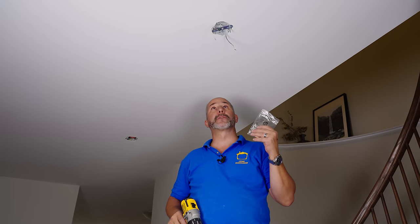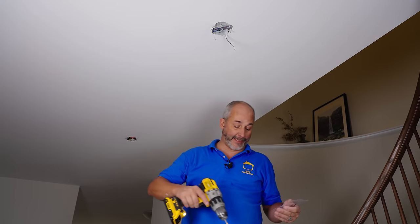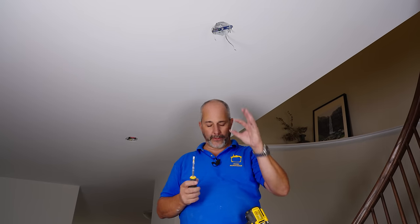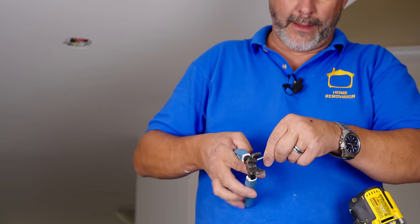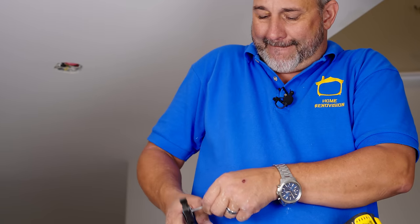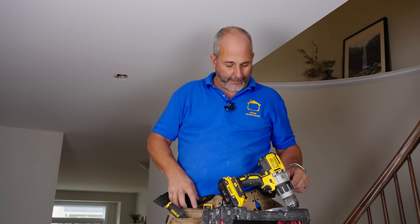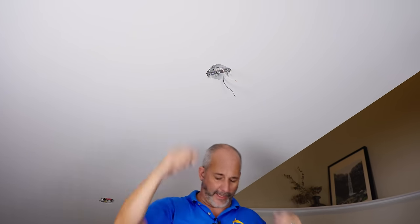Almost all of these screws are 8-32s. If you're an apprentice electrician trying to mount fixtures with a two-inch screw, do yourself a favor: grab your cutters, put the screw in, screw it in there, then cut the screw down to the right length. Don't put them in long. The octagon boxes come with their own short screws — use those because they're the right length. If you're an electrician with an apprentice, teach them a couple of tricks before they get started.